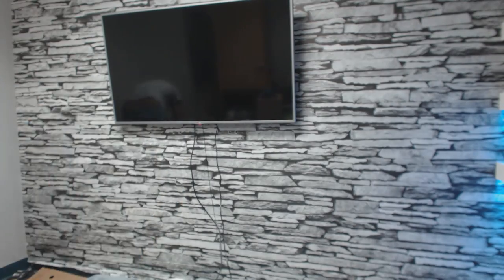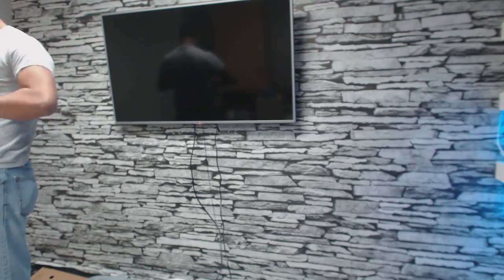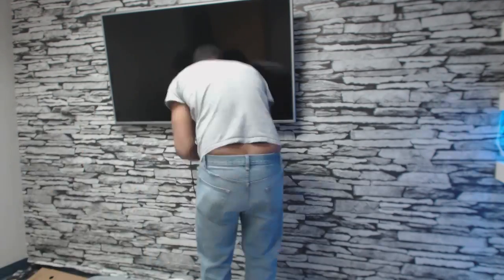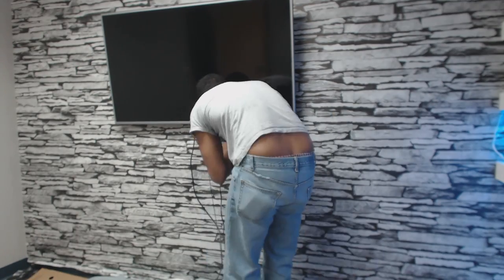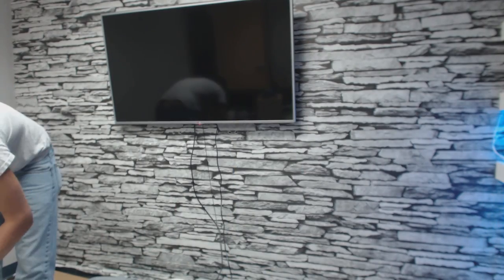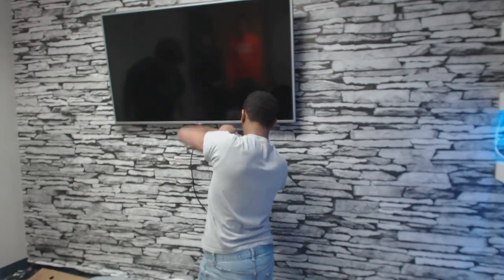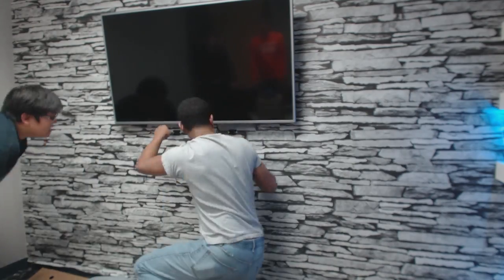The heavy duty drywall anchors that we got require pretty large holes to get drilled in the drywall so that they can go through and hold onto the drywall from the back. And the tolerances for the hanging mounts on the soundbar are actually pretty small. So when we drilled those large holes, the anchors were maybe an eighth or a 16th of an inch off. And the soundbar didn't want to sit perfectly in both of the teardrop shaped little drop things.